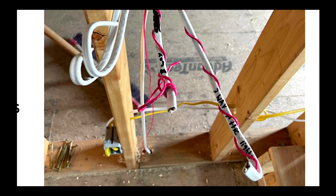For us electricians, you know that between those three-way switches we're going to have 14-3. So what they did here is they ran 14-2, and to get that extra conductor they just pulled out a THHN red conductor and went away with that.